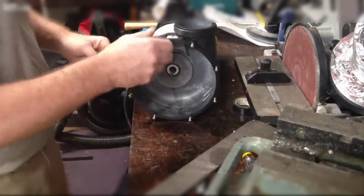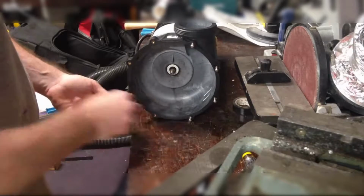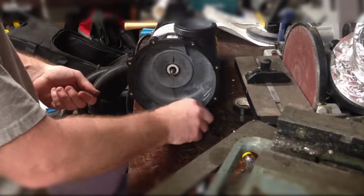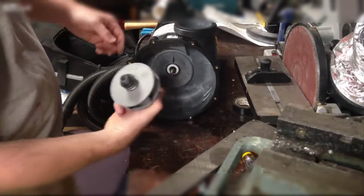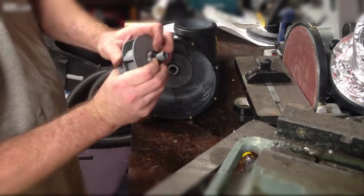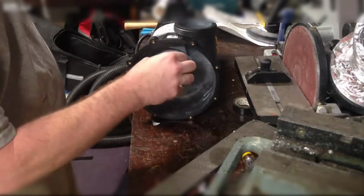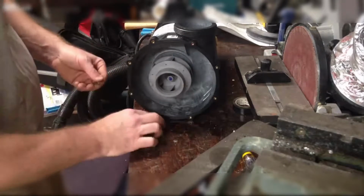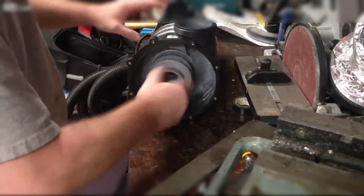So now that's on. Go ahead and I put these screws in when I was at the pool store getting the parts so I didn't lose them. I think this has a 2.5 inch intake and 2.5 inch output on the pump. So that just threads onto the shaft, and it's a compression type seal. Take the tag off here. So I bought this from R&S Pool Supply in Maryland Heights, Missouri, off of Highway 270 in Dorset. So get that kind of threaded in there.